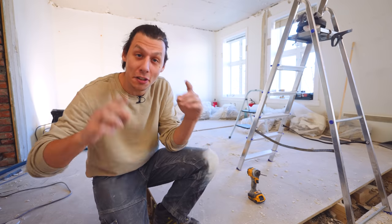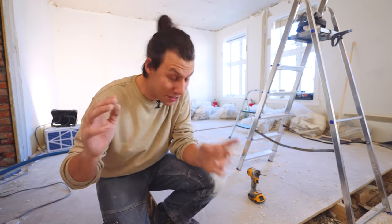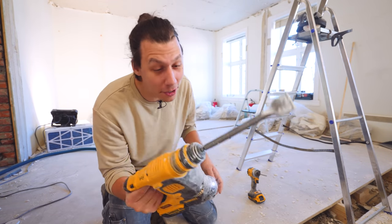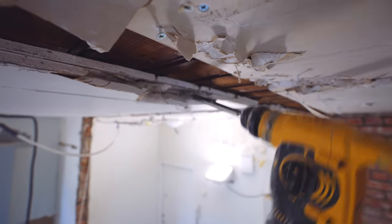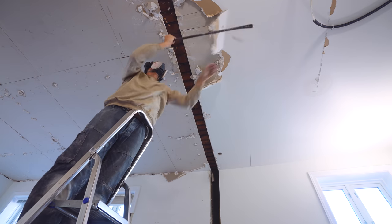I've managed to tear down the first layer of plasterboard in the main part of the ceiling. And just like last time, ripping it down is the easy part — although considerably harder when it's in the ceiling. It's the clean-up afterward that is just not fun at all. I think I figured out a pretty good way of doing this using a jackhammer to hammer into the edges where the plasterboard is attached to the screws, and then once that is loose, I can use the pry bar and pry down the big bits.